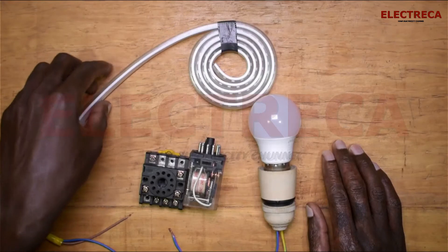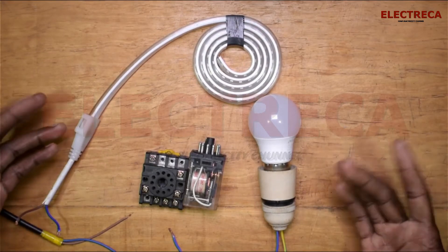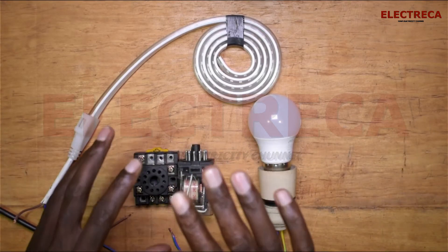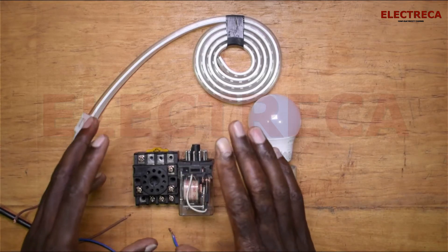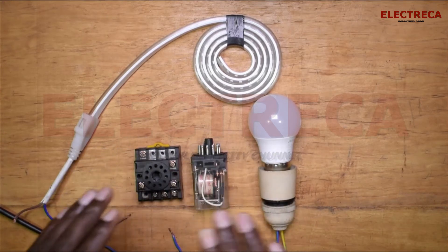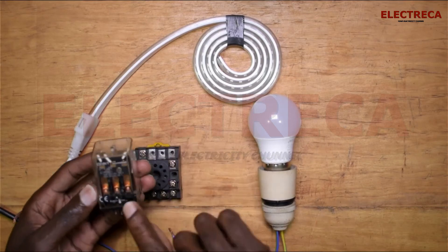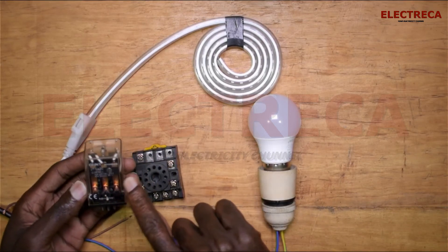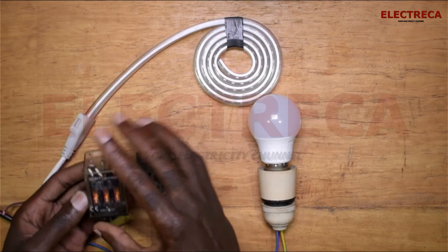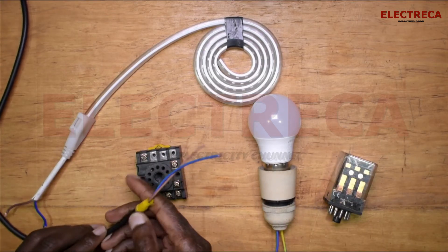Now we have our LED here and you will need a battery to light it. So let us demonstrate. This circuit is very basic, just follow along. This is a normal relay, and this relay always has an indication. If you look on the nameplate, it will tell you which contact is open and which contact is closed. You can always use a multimeter to test. So this wire here is our main.